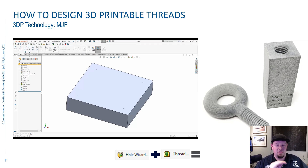We've used this extensively on parts going on our MJF machine to print threads. They're super strong — this half-13 eye bolt and block that you see on the screen here, we put that on our pull tester and broke that eye bolt at over 900 pounds in tension. It broke where the first thread on the eye bolt was, where that cross-sectional area of the bolt drops down. We were actually able to spin the broken piece of the eye bolt out of the block — the threads were still good. So don't sleep on the idea of putting 3D printable threads into your parts because you think they're not strong. They're really strong.